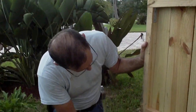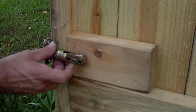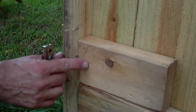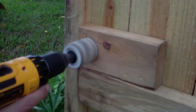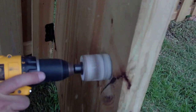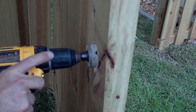I've taken the tongue and marked my spot. Using this tool because it has an adjustment — it can be short or long — I'm using the longer portion to get it deeper. You can see my mark there. I'm simply going to take my drill with my hole cutter. We've gone through and there's my plug.